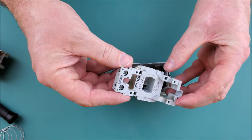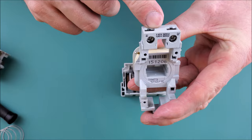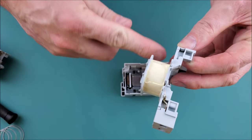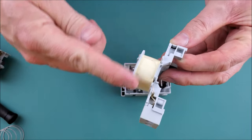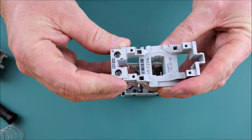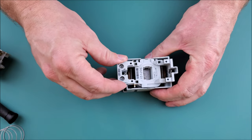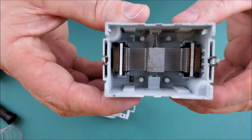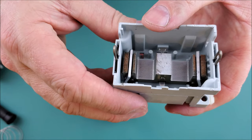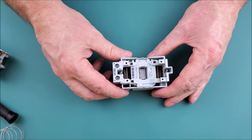Here is the actual armature. The core is still in the base of the unit — it's laminated steel plates, likely heat treated or chemically processed, stamped on a press and riveted together under pressure with no gaps between them. The base of the contactor houses the coil, which generates the electromagnetic field. These are the two terminals where you connect your 120 volts AC coil voltage on this model.